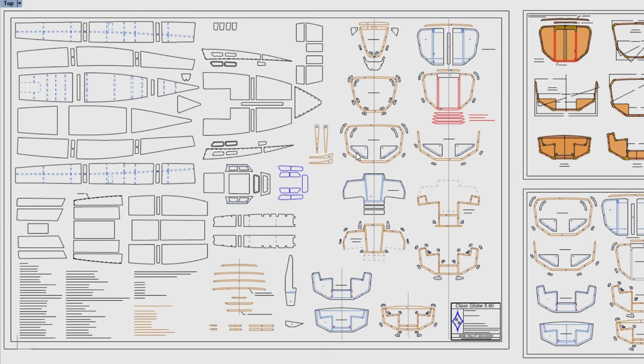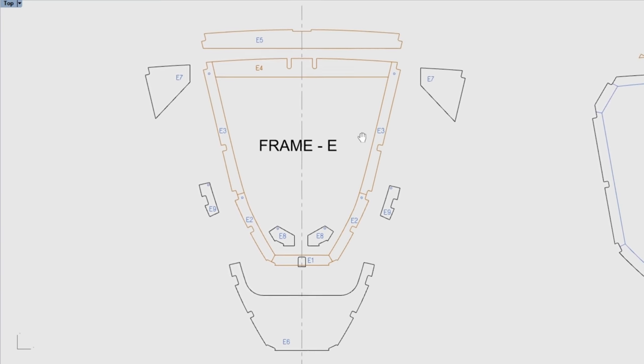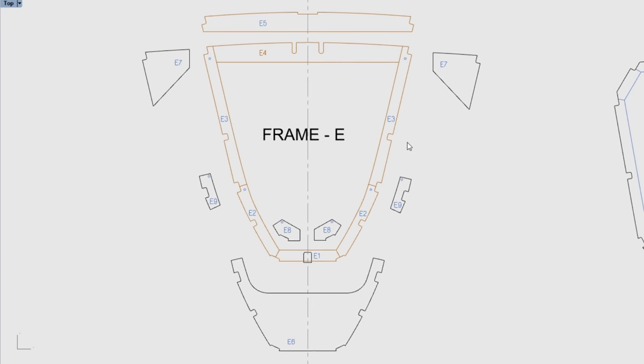This kit is unique in that it has a lot of solid timber framing because it's not a stitch-and-glue boat — it's frame-and-plank construction. On the inside of all the frames we have solid timber framing. For example, frame E has a top beam, side pieces, chine pieces, various gussets that connect over the joints, and a second beam on the aft side with a dado for the stem knee.